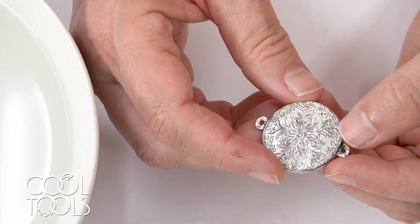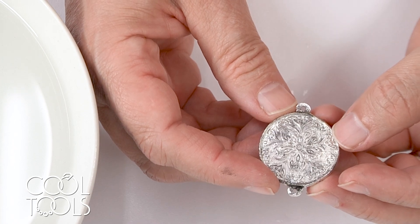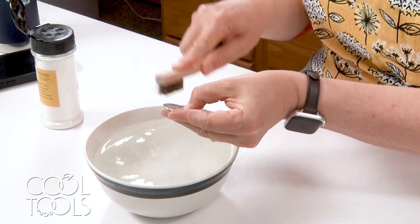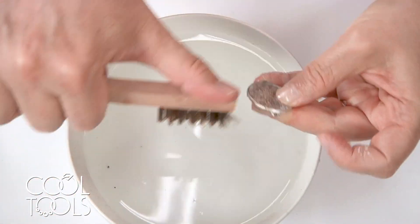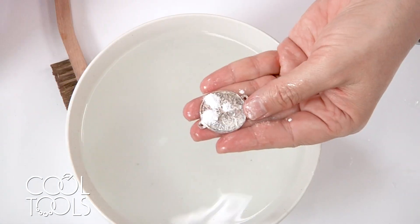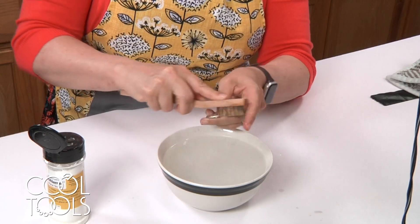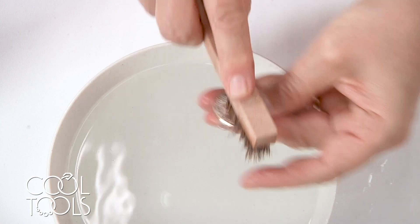That's not uncommon, and that's why I said you shouldn't do this unless it's a last resort. If it's just going to go into the scrap bin anyway, there's no reason not to. But I wouldn't use it just because I wanted to change the color. I do need to do some work on it before I can re-enamel it. I'm going to start by cleaning it with pre-enamel and a stiff wire brush — I'll put a little of that on it and brush it really well to get all that black stuff off. That's just soot left over from the process, and it comes off pretty easy.